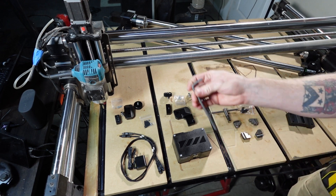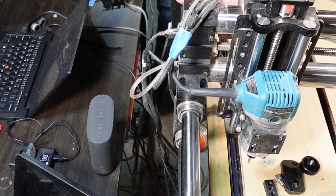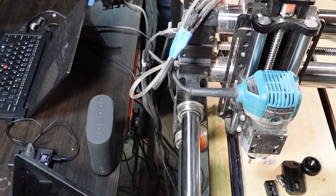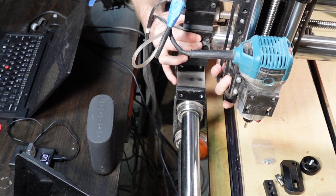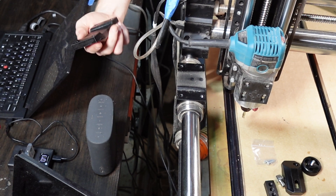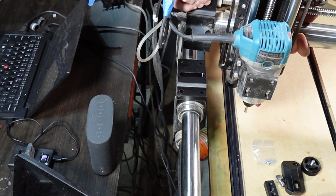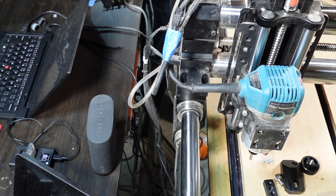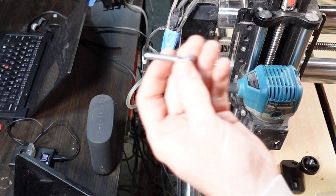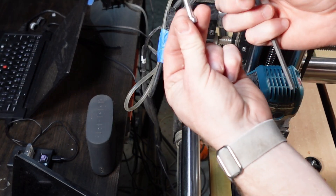First thing I've got to do is install these risers for the X-rail. It's going to be a 5mm hex key to get the bolts out, and then we're just going to screw right back down on top of this. This shouldn't cause any drama with your tilt configuration because the riser just adds height. I'm going to add the riser on the other side, make sure it's flush, and then install the eight new bolts that came with the kit.